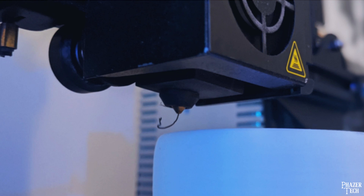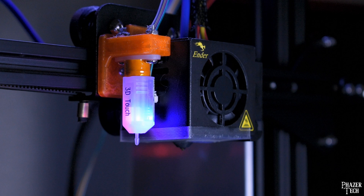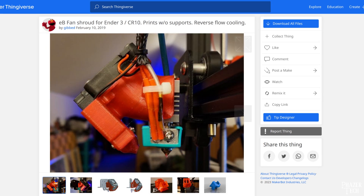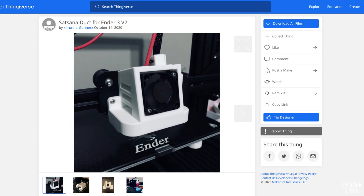Speaking of airflow, you might have noticed the hotend shroud has openings at the bottom that allow air to blow on the print in a way that isn't exactly desirable, so printing out this cover will help ensure the airflow hits the nozzle like it's supposed to. I'm not sure how useful this part really is, but it seems to help at least a little bit. If you decide to print it, I recommend using something other than PLA since this area can get pretty hot — I printed mine in PETG and used silicone adhesive to attach it. If you're feeling adventurous, you could also print out an entirely new shroud. There are quite a few different designs on Thingiverse for this, some of which allow you to use bigger fans. I haven't done this myself since I'm happy with how it's performing, but I'm considering it in the future so I can use thicker fans that are quieter.